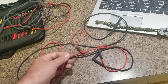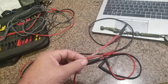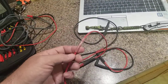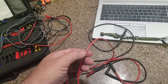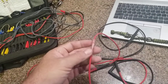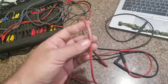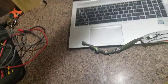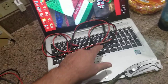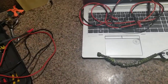I had a bad test lead. These are silicone — I love them — but this will be about my fourth set of test leads that have gotten damaged. On close inspection I found an indentation in the lead, so I cut a section out, butt-connected it, and it worked. However, the resistance with the butt connector was about four or five ohms higher than normal.